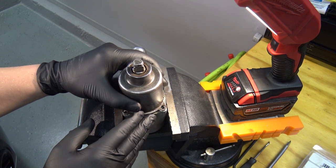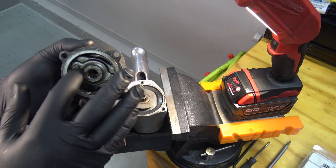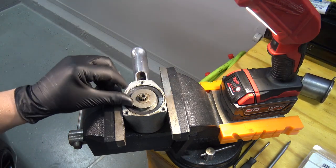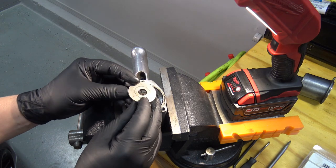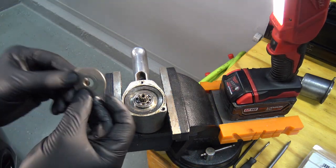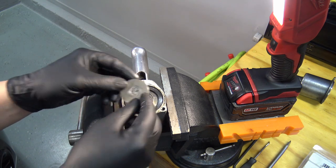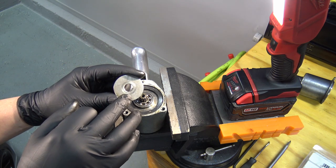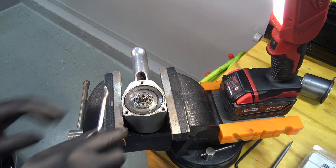This mechanism right here simply lifts right up. There's a ring that holds the mechanism inside, so leave that together and put it off to the side. There's a washer here — one side is flat and the other side has a bump up in the middle. The bump-out faces down. If you're unsure which side is which, there are witness marks inside so you can match those up.